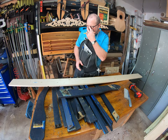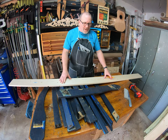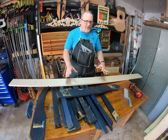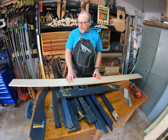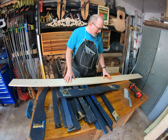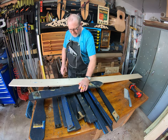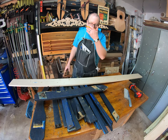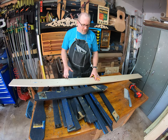When you plan your lumber, as soon as you get it home and start building, mark it all out. Make sure you have enough, and if you don't, go back and get some more. Don't wait until the end. I hate it when I'm halfway through a project and I don't have enough fasteners or finished materials. Mark out all your pieces, and the next step will be to go to the compound miter saw and make rough cuts on all of this.